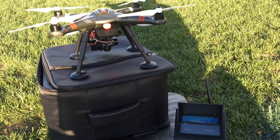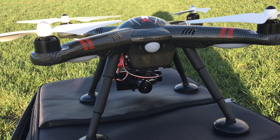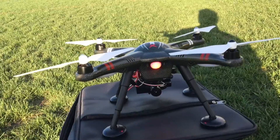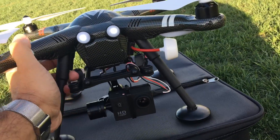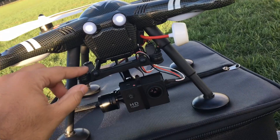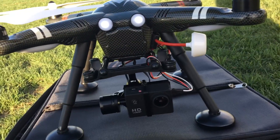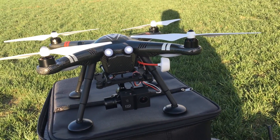We've completed the fly-around with the stock battery — we flew around until the red light started blinking, indicating battery level is low. It came in at just over 15 minutes; I believe it was 15 minutes and 26 seconds. My guess for why it was low is not only was it in constant circular flight, but I have this thing fully loaded with weight, and the camera and the transmitter are plugged into the power supply so they're also taking voltage.